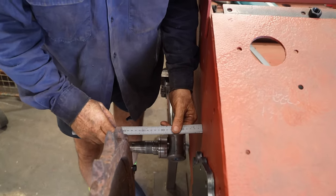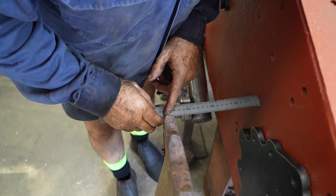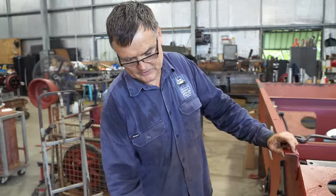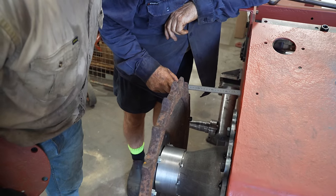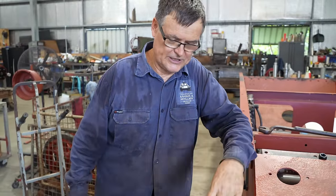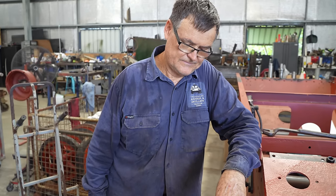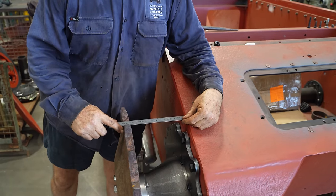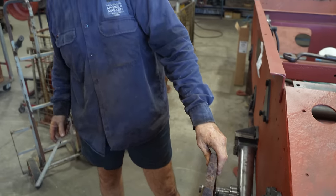What's it supposed to be? About 186 or 187mm. So I'm out a bit, but I know where I can fix it — I can take a little bit more off the hub here, probably about 8mm off. How much clearance is there in the track? The track's got heaps of clearance, but we still want it to come out otherwise everything's going to be pushed right out — because this is your centre. So we can have it out slightly. I'm off there about 6 or 7mm, but I can shim a bit more off here.